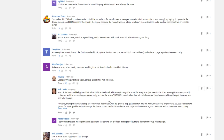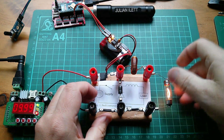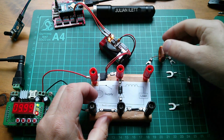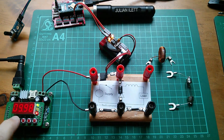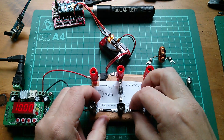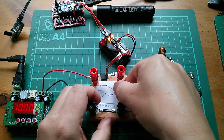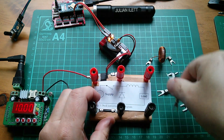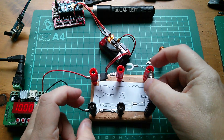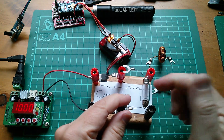Well, let's have a look. Let's take this lamp off, take the inductor out, which I can do like that — the power's still on, I should turn that off I suppose. Let's take out this diode, take out my new little link wire that I've just made. Take out the diode — yeah, bent it a bit. And just fix the bulb here, so that all we've got in the circuit is the MOSFET switch and the load.